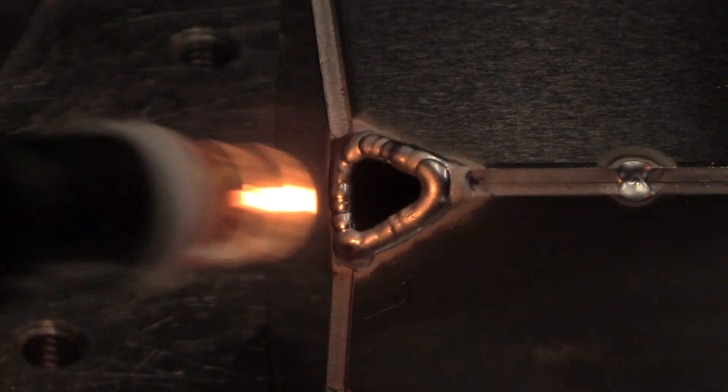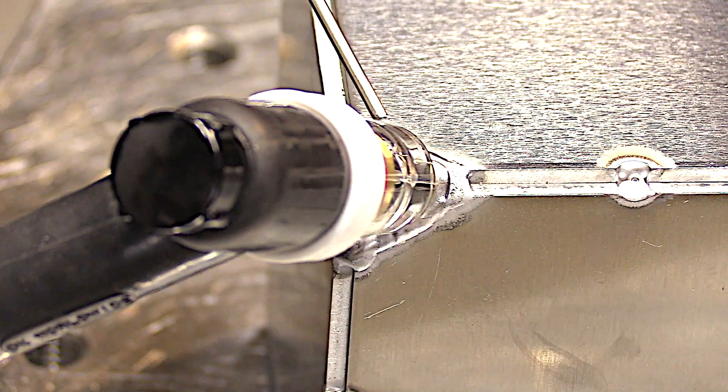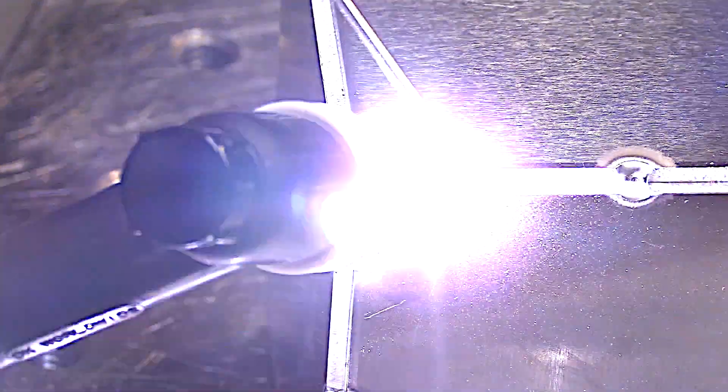You need a little bit more of an argon envelope and possibly more stick-out so you can see what's going on. I'm running a bead on this edge here to simulate filling in a hole. You would run a bead around the edge first, get that done, maybe let it cool for a second, and then come back and fill it in. Hole fill is a really common task in a welder's life — whether it's repairing a pontoon or a rivet hole that wallowed out. It's pretty straightforward, but it really helps to have good shielding and it can also help to be able to see through the cup.